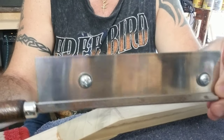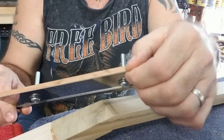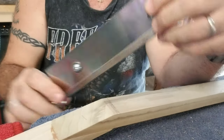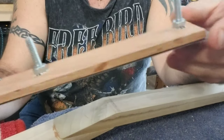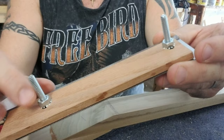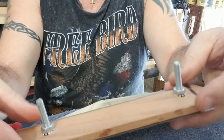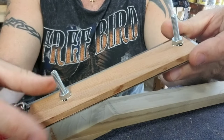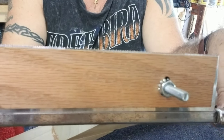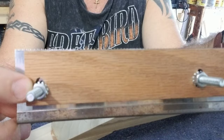What I've done is I've taken this fretting saw — you've all seen these — and it has a .023 kerf, which is the thickness of this blade. This hole here was already in the saw when I bought it to hang it up. I put another hole here in the saw and attached a piece of oak that's very straight, flat, and true on this end. I've drilled a few different holes going this way, so this board will move up and down — I can change the depth of the saw cut. I've got it set where just the teeth are showing all the way across, and tightened down with lock washers and these little nuts.